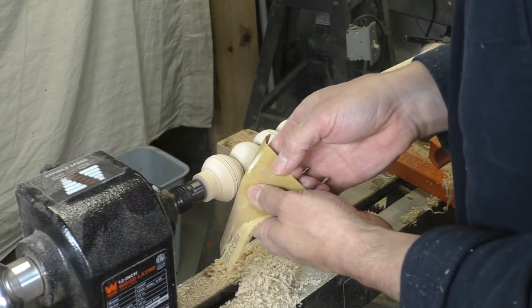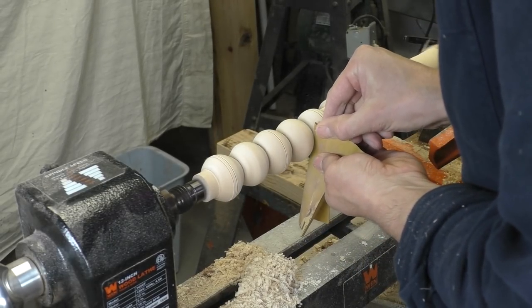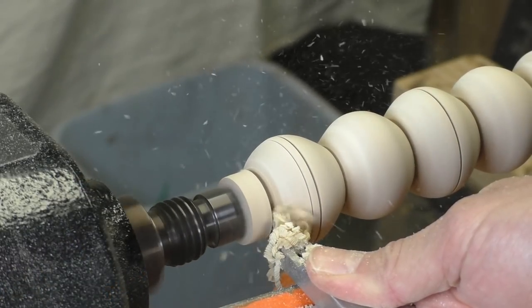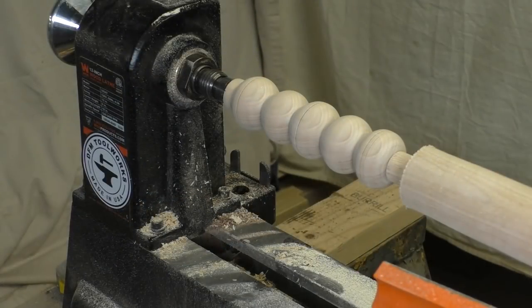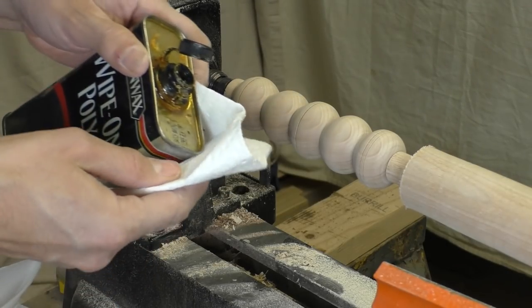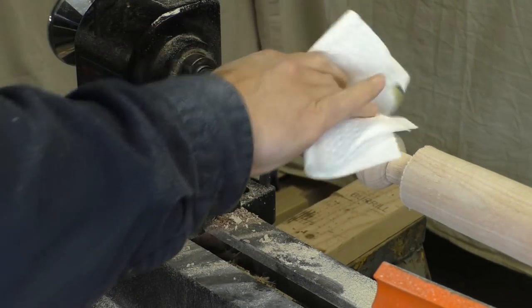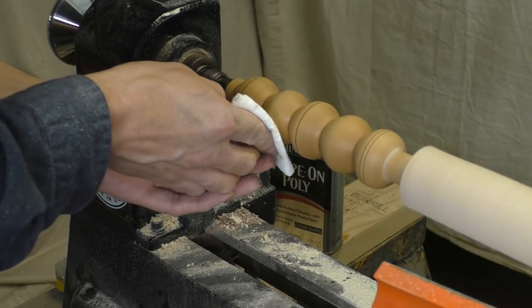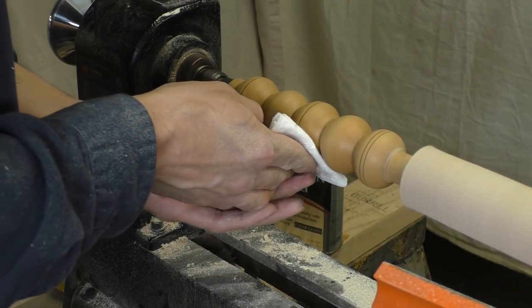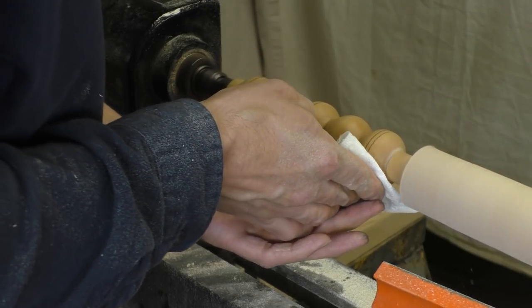Sanding this piece is easy — I just keep the paper moving and don't stay too long in one spot. Folding it gives me a sharp corner for getting into those tight details. I got a pretty good finish off the tool so I'm just using 150 grit and stopping there. I turn down the end and leave just about half an inch of wood, then finish sanding those details. You can leave the piece unfinished, but wipe-on polyurethane is nice because it's thin and it soaks in fast. I slather on a bunch of finish and turn the lathe on, holding a paper towel against the wood to spread it around, then switch to a dry paper towel at the highest speed and press firmly to build up friction — it heats up the finish and makes it dry almost instantly. Note that I'm only using paper towels. A cloth rag can get caught and pull you into the work — never bring a cloth rag to the lathe.